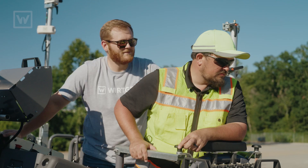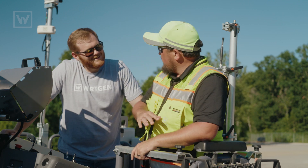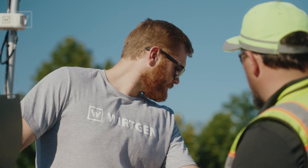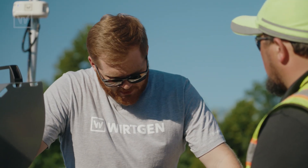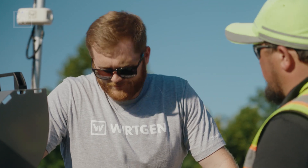Austin! Donny, what's up? Are you able to fix this issue? I got one going on with my curb. What issue? Austin, Donny's mold is hunting — it's going up and down, and we can actually see it in the top of the curb, a little bit of waviness in there. Is there anything you can do to help him out? Actually, there is, Donny. Your rear track is pretty far away from the mold. What I want us to do is get it closer to the mold for better machine stabilization, and it's also going to give us a more accurate slope adjustment. All right, let's do that. Let's do it.